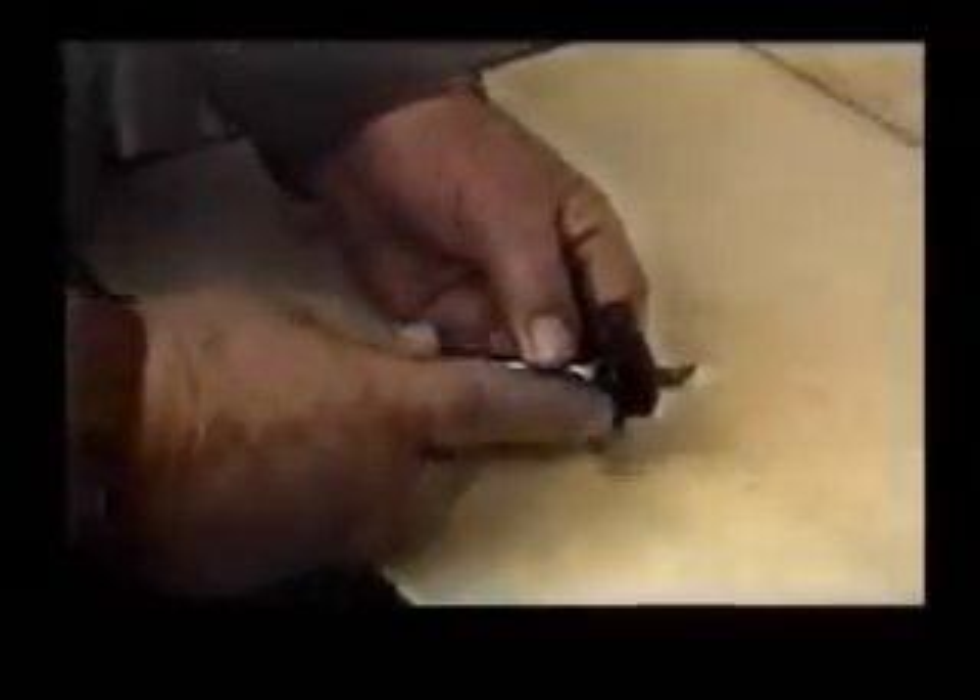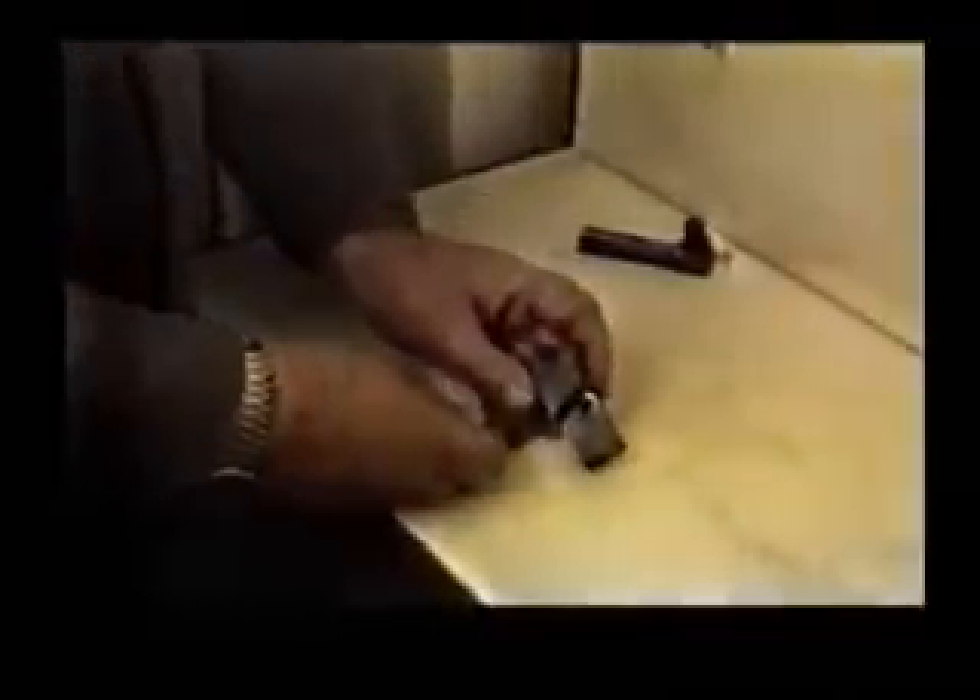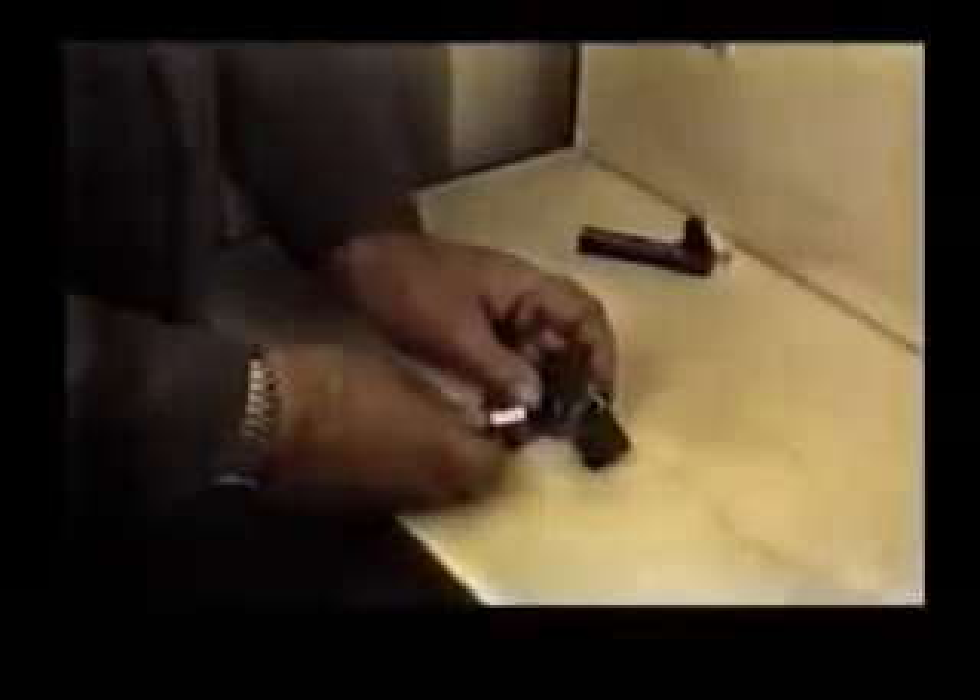Take a standard piece of square high-speed steel which is conventionally sharpened. The compound angles involved are difficult to achieve but also more difficult to maintain when sharpening. The diamond tool holder system overcomes those problems in various ways, beginning with the grinding fixture.